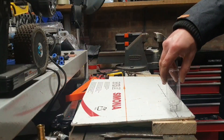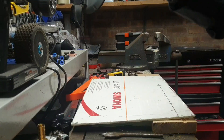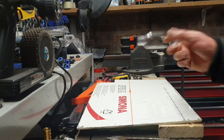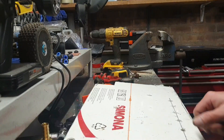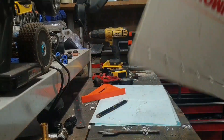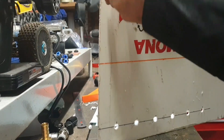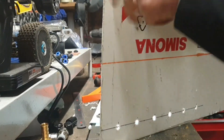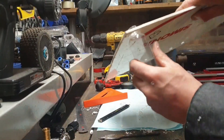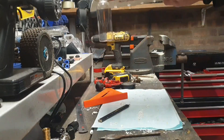New plan: drill six holes, big enough for that — it'll almost thread in. We'll hang that from something, going in from the bottom, giving a nice clear view of what's in the jar. Six pilot holes drilled, go in with the stepper. I've done a pilot hole here and then it threads in nice, then that'll hold them all and we'll make a hanging bracket from there.